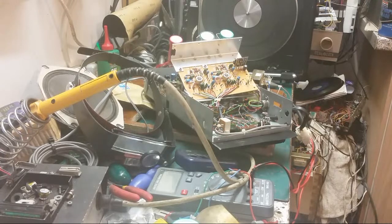I will check the output transistors, especially in that channel that's got a blown diode. There's them two. There's no drivers, though. Where there's outputs, you expect to find pre-drivers, and there is none. I think the pre-drivers are done through them ICs. There's two ICs, one for the left and one for the right. So I might swap them as well, because I don't really want to throw components in and keep blowing components. Cheers for that, Steve. I owe you one, my friend. Nice one.